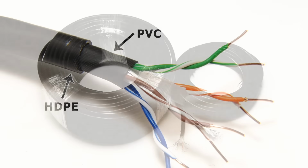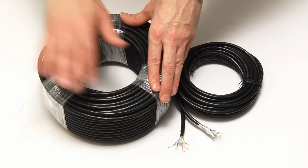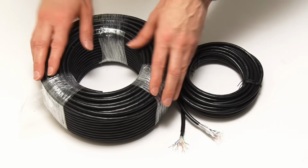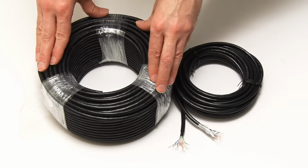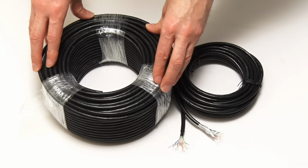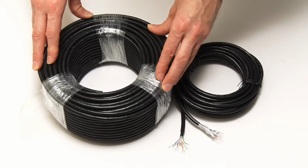And so there we are, and I bet you never thought there were so many things I could tell you about network cable. But if you are fitting a permanent Ethernet connection in particular, it's critical to get the cable right. And I hope that for me, this Cat6 solid core, solid copper AWG24 direct burial cable will prove a good long-term choice.